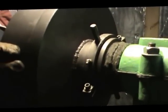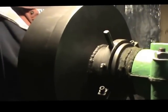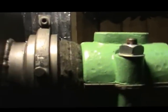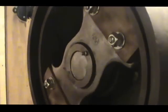Alright, here we are. We've got the shaft cut off and we have put the spider on here. As you can see, we've added a few felts here behind the clutch collar to hold the grease in between on the Babbitt, Byron. And here we are in the front of this. You can see where we've cut the shaft off. And Byron's going to point there.